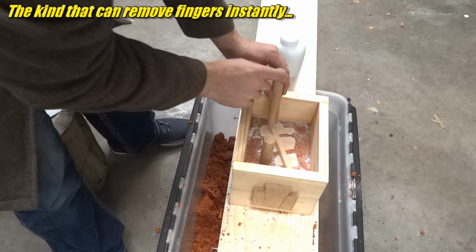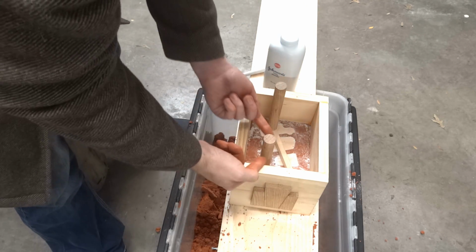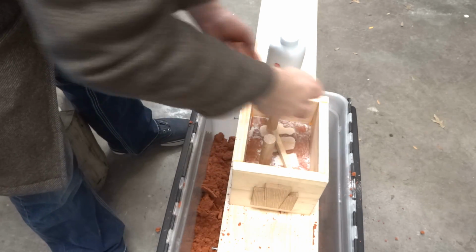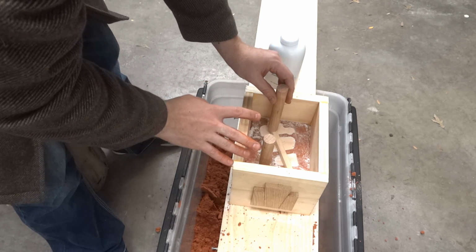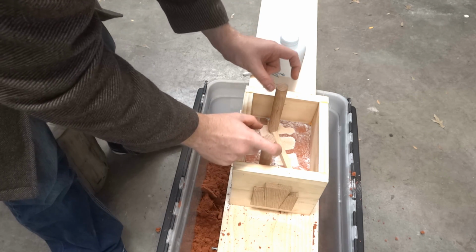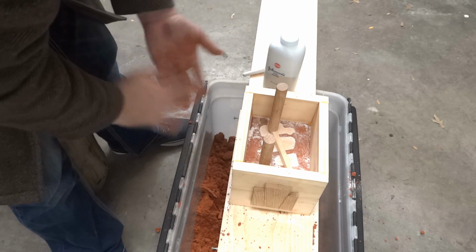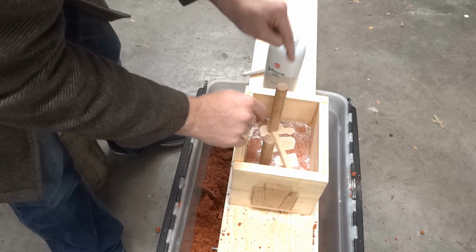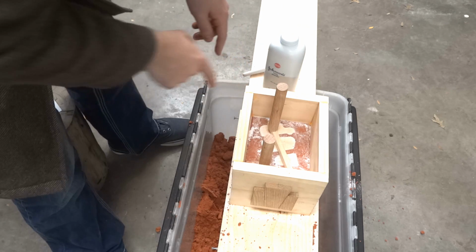Then, optimally, I would have a second riser here. And what that means is, when it's poured in, it'll go down here. I'll try to keep this filled up so there will be pressure pushing it down, which pushes it through all this and up here. Then I'll be done pouring when there's liquid metal in both, and at that point I'll just let it cool. And these two big thick posts, which are fairly thick, remember these are only 1/4 inch, the gating's 1/2 inch, and this I think is bigger than 1/2 inch. So these won't solidify until last. And while the thin castings solidify, liquid metal will be able to run down here, probably specifically this one, and fill them up as they solidify.